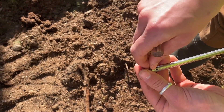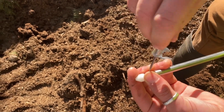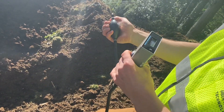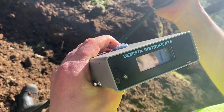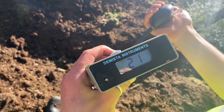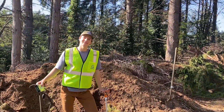Once you've cleaned it out, put the screw back in. Once you've got the tip back on, you can recalibrate the probe. As you can see, I'm at 21% after pumping it a few times, so we're good to take another oxygen reading. I hope you guys found that video helpful — thank you for tuning in. Happy composting!